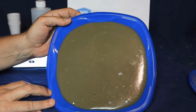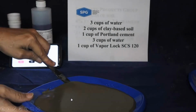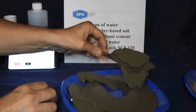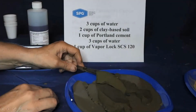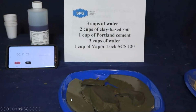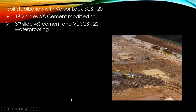Amazing results achieved economically. Not only economically, but sustainably. That reduction in the Portland cement, saving 275 million BTUs for every acre. Scott, that's the equivalent of 13.2 tons of coal saved in an acre of material. Now, instead of sitting in your trailer watching critical path days fly off the calendar because your entire job is in the mud, we can put you up and running from the start of your job.